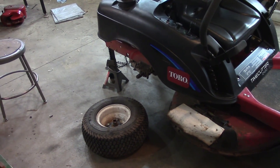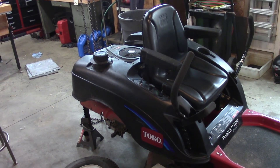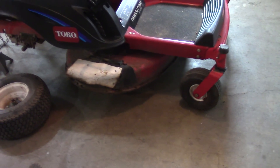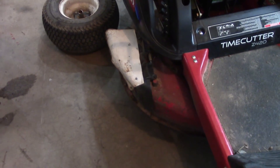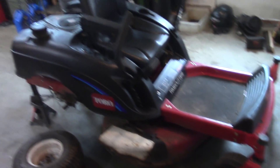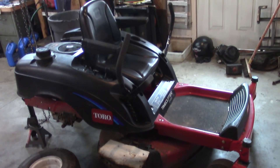You can get the aftermarket kit from Amazon for about $105 per side. Everything else with this tractor works — I jacked it up, tested the hydros, they all function properly. The blades seem unbalanced or bent, so I'll need to work on those. The front spindle yoke is bent a little bit, I'll need to straighten that out, and I need to get a deflector. I figure I'll be about $400 total into this mower, and I think it's worth about $900, so I should do all right on it.